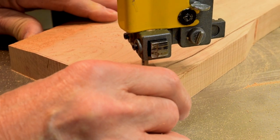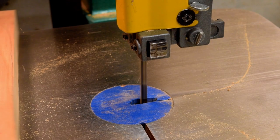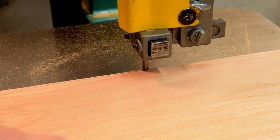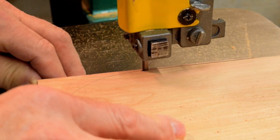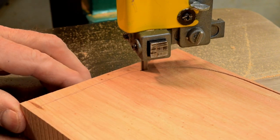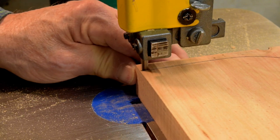It's easier on your blade if you mess up and push the blade sideways and have the blade actually hit the metal part of the insert. So the plastic is more forgiving and tends to keep my blade sharper longer, particularly when taking sharp corners on the bandsaw when the blade is pushed one side or the other more than ordinary.